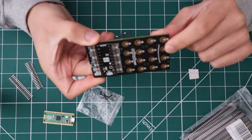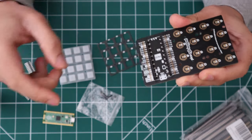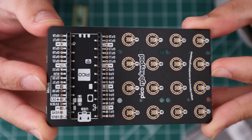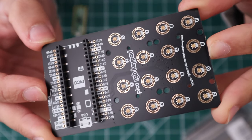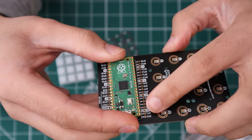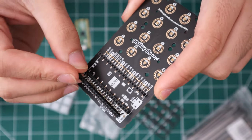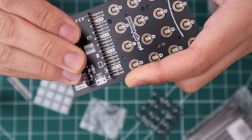As you can see, these are just little surface-mounted buttons for the silicon there, and then you've got the pinout for the Pico which sits on top. All these break out into the individual pins as well, which is quite neat — so you can see all the pins break out, and if you did want to use them for something else, like if you had the keypad and wanted to build something on top, you can still use the pinouts here, and they're all labelled for your convenience. First things first, I'm going to put the headers into the slots here so I can line them up with the Pico and get them soldered on.